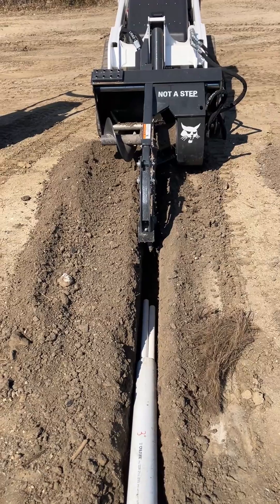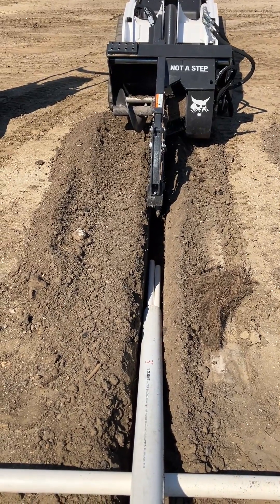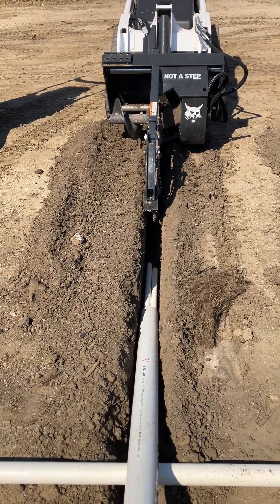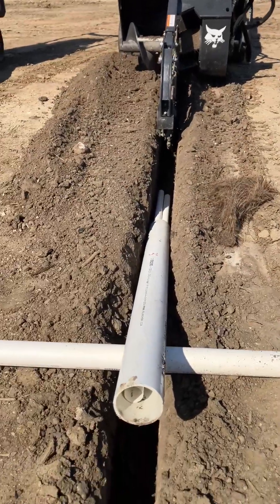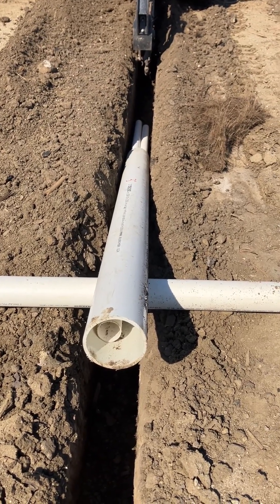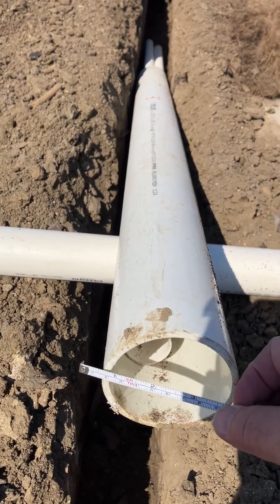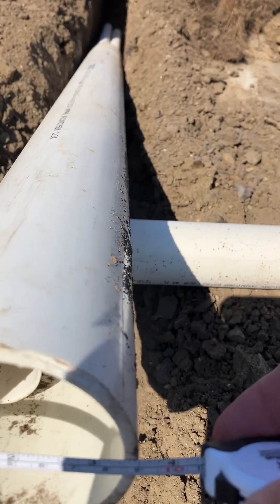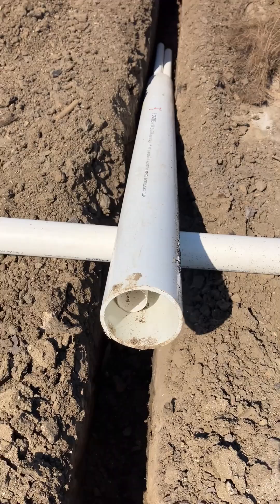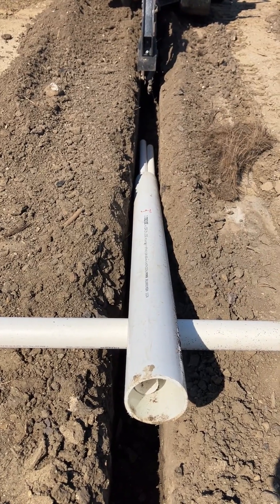It allows you to put multiple 1-inch pipes in, and you can run up to 3-inch pipe. But you're wondering, why can't I use the 4-inch? In a previous video, I showed that the 4-inch corrugated was a slight fit, but 4-inch PVC will not fit. That has to do with the fact that PVC piping is measured from the inside diameter. This is listed as a 3-inch PVC pipe — that's the inside diameter. If you look at the outside diameter, you can see it's well above 3 inches. So a 4-inch pipe will have an outside diameter larger than 4 inches, therefore it won't fit.